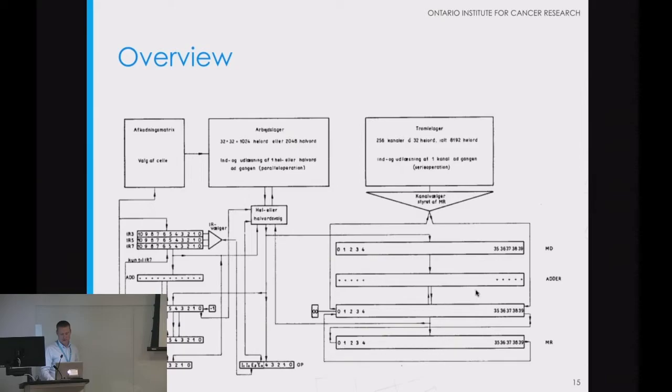This down here is the closer you get to the ALU. This is the accumulator register, so if you're doing addition, you would store a value here. The next time you get another value, you add it to the value which is currently there. There's the multiplier register. So the way you would do 2 times 3 is to do 2 plus 2 plus 2. And the multiplier remainder register. So this is a normal calculation method. This down here is the operator instruction register, which will contain your instruction. Down here called BR is a binary counter. So there's a register you can use as a counting method.